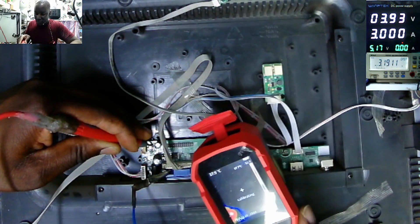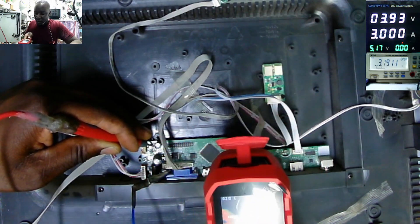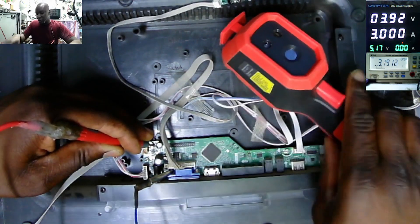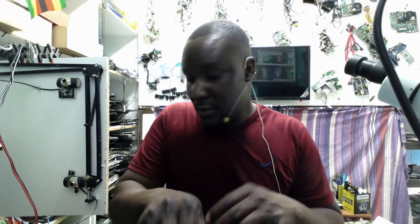We have another driver here. We can't even hold it — it's very hot. This is unfortunate. I'm very sorry to the customer. This time we can't fix this. This is the common fault on these 17, 19, 21, 24-inch TVs — the processor is dying so easily.